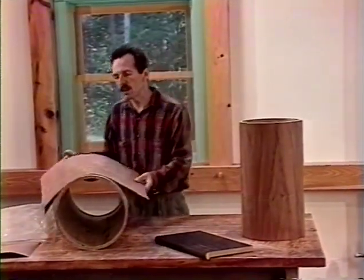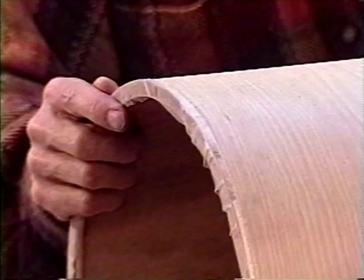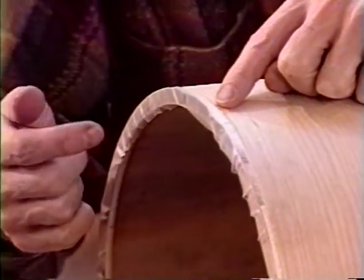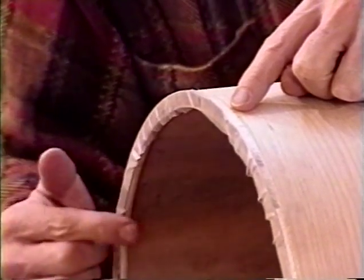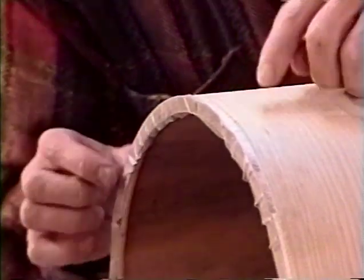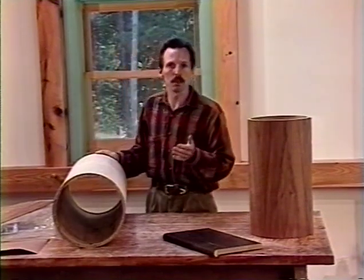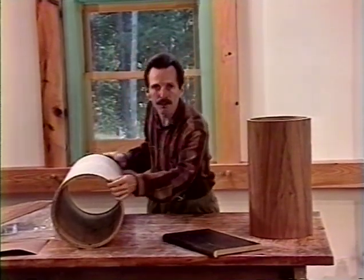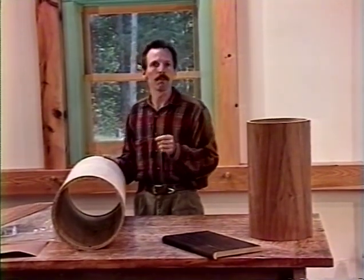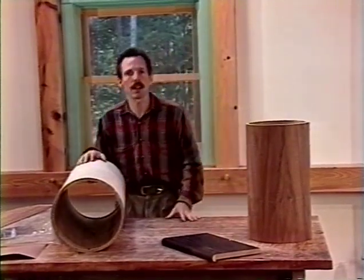To prevent the excess veneer from snapping off over the edges, I've attached these 1/4-inch extenders on each end of the cylinder with some brads, and then I flush trimmed them back to the cylinder and put on clear packaging tape to prevent glue adhesion. This way, after the cylinder has been pressed, I can pop off these and trim the veneer back to the cylinder. If the cylinder can be trimmed afterwards, then these extenders are unnecessary.